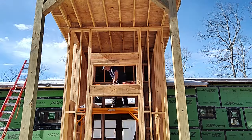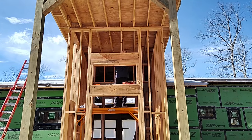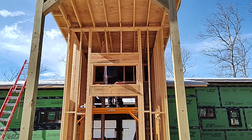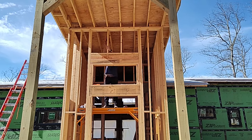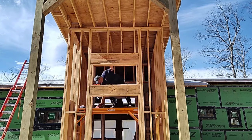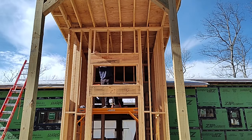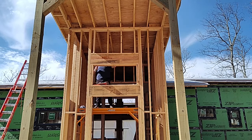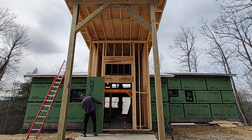For the framing here below, there's a header for the door and that's a 50-inch wide opening, 80-inch tall, which is standard. I made it this wide because we might put a door with side lights and we at least want a 36-inch door, so we're still determining exactly what kind of door we want to put in. Above that there's a picture window — about a two-foot tall by four-foot wide picture window centered above the door — which is what I'm framing the second header for, and then putting in the studs.